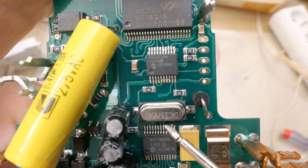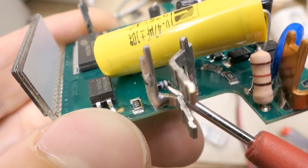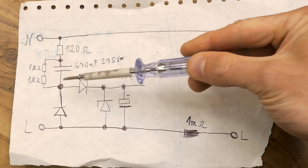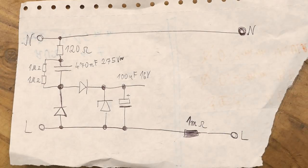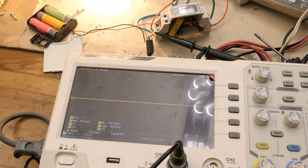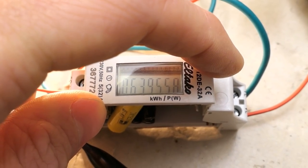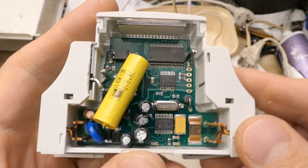There seems to be a component in series with the SO interface — is it a resistor, a fuse, or something? It was reading open circuit using a resistance meter but it actually turns out to be a diode. Here's the capacitive dropper power supply — it rectifies just one half cycle so the output voltage can have a common terminal. I'm trying to capture some pulses on the interface using an oscilloscope but I don't see any. I'm using a battery and a 10kΩ resistor, sensing on the resistor, and nothing. To connect the oscilloscope I'm running it via an isolation transformer to make it safer — not to rely just on the optocoupler. Is it faulty or am I just missing something?